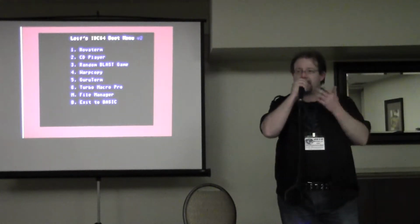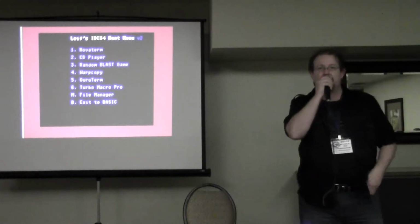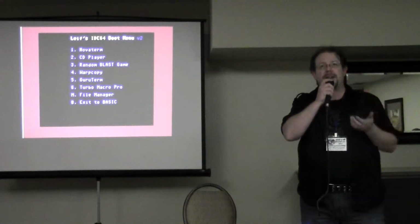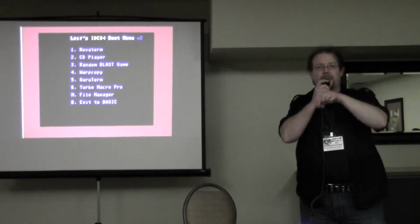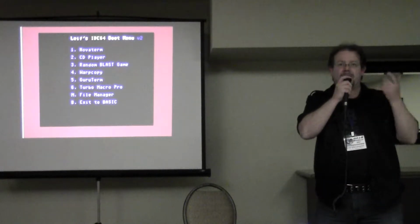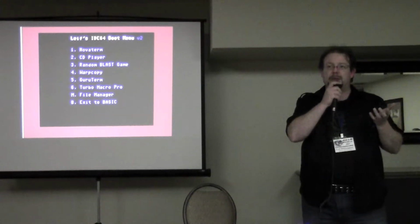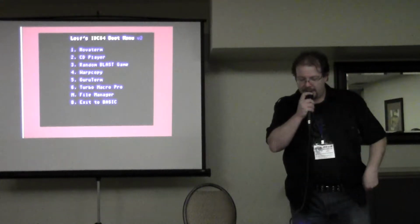So as many of you know, the sound chip in the 64 is the SID chip with a couple of different variations, but they're getting hard to find. So there's been a few versions of microcontroller-based SID emulation. These are pin-compatible chips that you drop in as a replacement to the SID, and they run an emulation engine internally and try to reproduce the SID sound. I think it sounds really good. Purists are a little unsure, but it's a very cool project nonetheless.